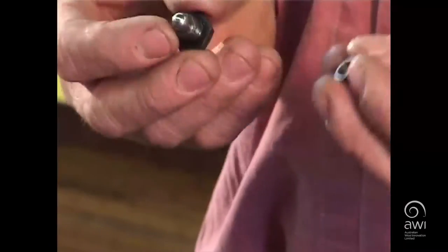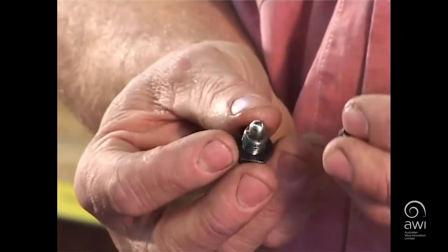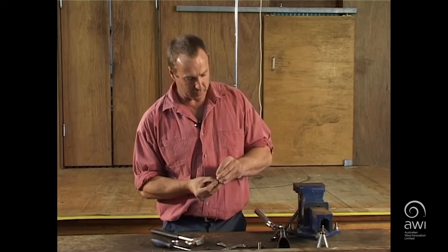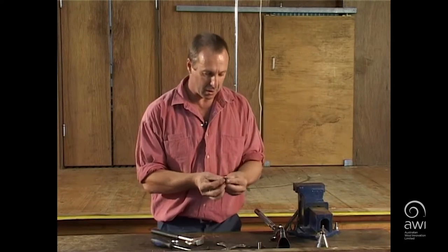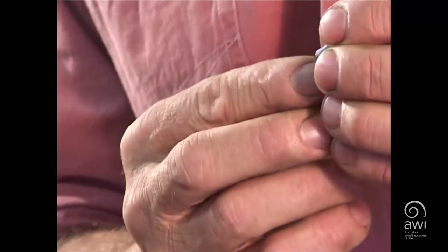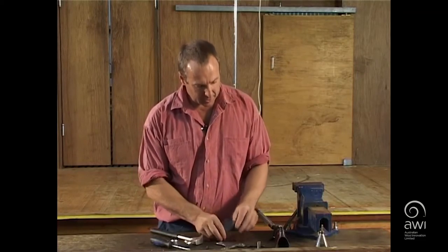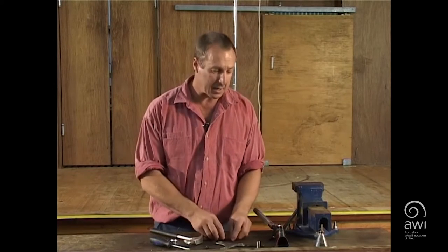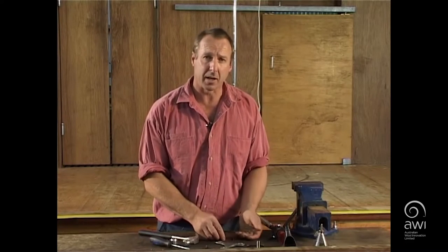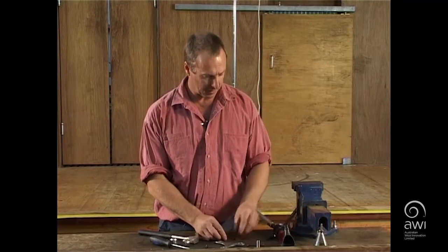When we get wear in the post and cup, the uneven wear will create vibration and the post will not sit evenly into the cup. We have a flat point which is produced on the back of the post, and we have quite a considerable wear point at the back of the cup. This will create vibration, it will create heat, and most importantly of all, we lose our crisp cut. And then we have all sorts of problems occurring.